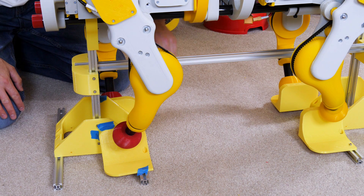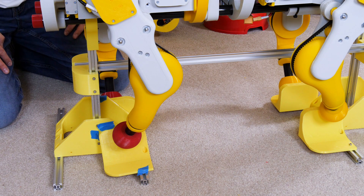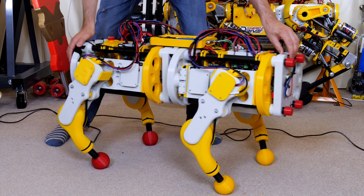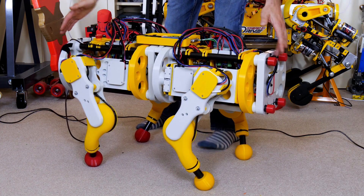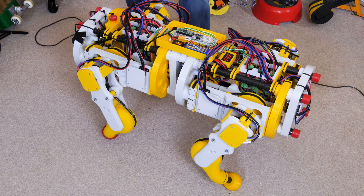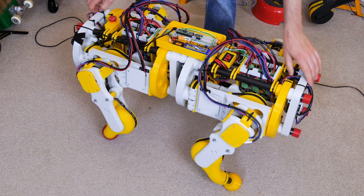The dog is on its stand at the moment. I've got a piece of 2020 extrusion here — I'm waiting for a longer piece to arrive to make the stand symmetrical; that's what the blue tape is holding. This is my zero position pose for calibration on power up, but eventually I'll use absolute position on the encoders or the z-index offset to automatically position those legs. With motor holding power on, it feels a lot better balanced, though it still has more tendency to fall backwards with the knees partly bent. Turning those legs inside out feels much better because now the legs oppose each other and it doesn't want to fall in either direction — much more stable, and the sway is noticeably reduced.